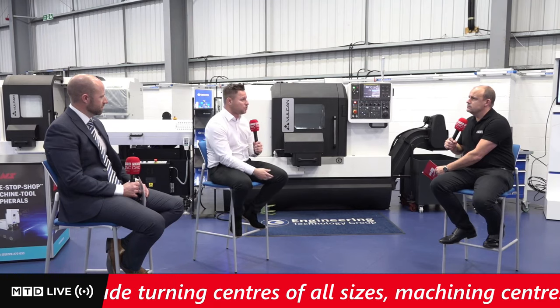The application we've got here doesn't look like a real-life component. Could you give us an illustration of the sorts of parts where this strategy fits? When you look at stage machining, that's probably a go-to straight away, because on the factory floor you typically see half-hour to 40-minute cycles to rough billets out. You have fewer tools in the machine, massive cycle time gains. Components would include motorsport parts, bevel gears, camshafts, deep pocket areas, and groove areas.